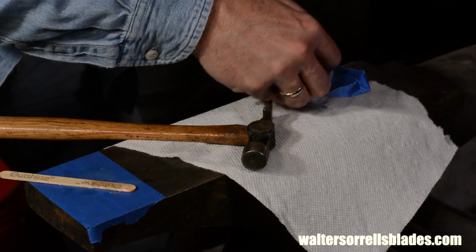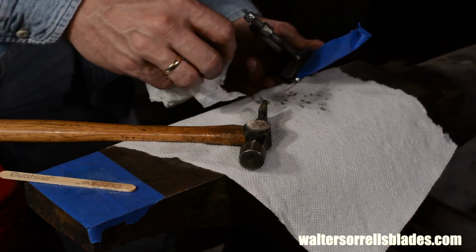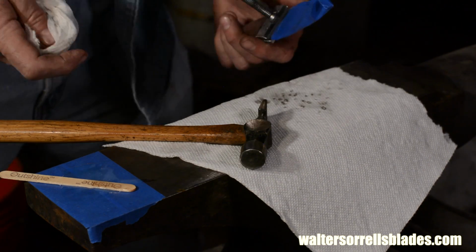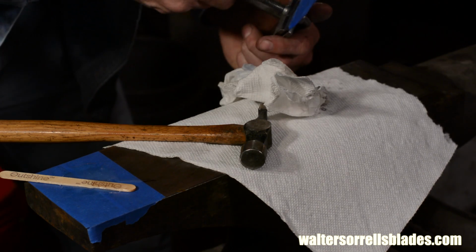If you don't, you'll scratch up your blade trying to remove it later. I'm using lacquer thinner because I'm hoping to grow an excellent crop of cancer in my brain. You may use something smarter. Don't go nuts with it though. You don't want the solvent getting in the glue joint and leaking all the glue out of the bolster. Just enough to remove the squeeze out, then clean it up and you're done.